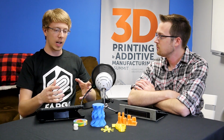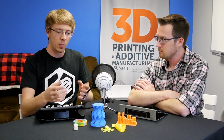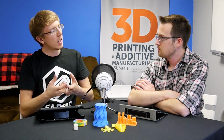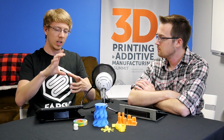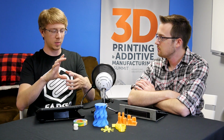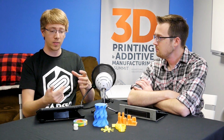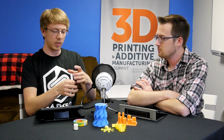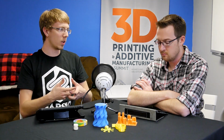Sometimes, if you don't need a raft for any reason, you can actually put a helper disc in the center to hold that support down. I was running into an issue with one of my prints: a cylinder about the size of a small coffee can. I didn't need any supports or rafts, but in the middle I had to have 3 supports running down. The supports were peeling up, and if I did a raft, it would actually ruin the part.